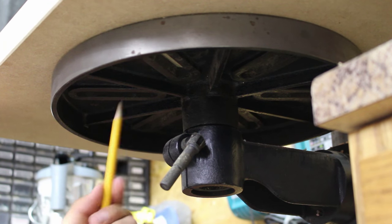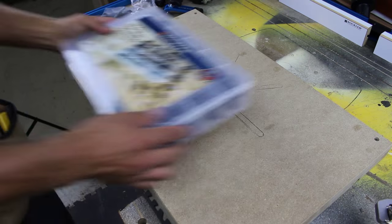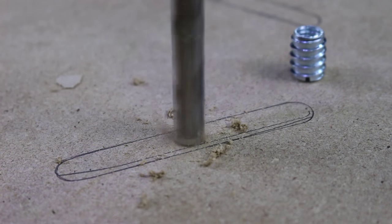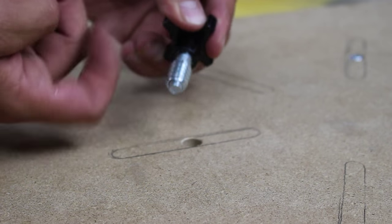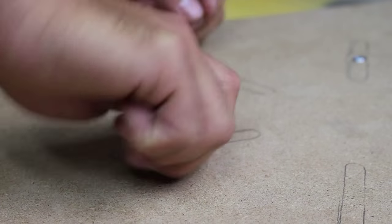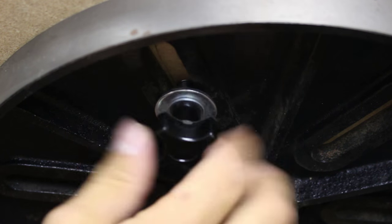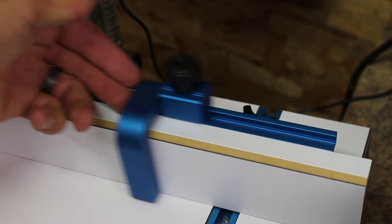I place the table on the factory drill press table and use a pencil to mark the slots. I pull out my jig hardware kit and grab three threaded inserts and three knobs. Simply drill a pilot hole, and then a neat trick is to use the threaded knob to help screw in the threaded insert. Replace the table and screw in the knobs to secure the table to the drill press. Now let's give it a try.